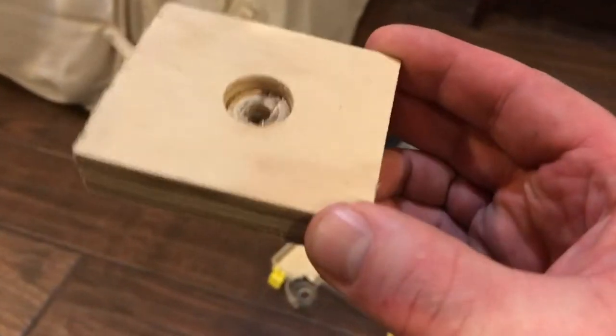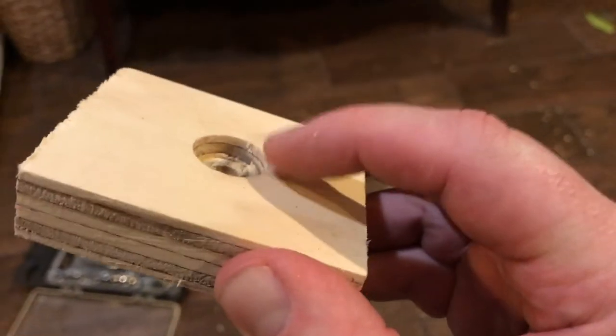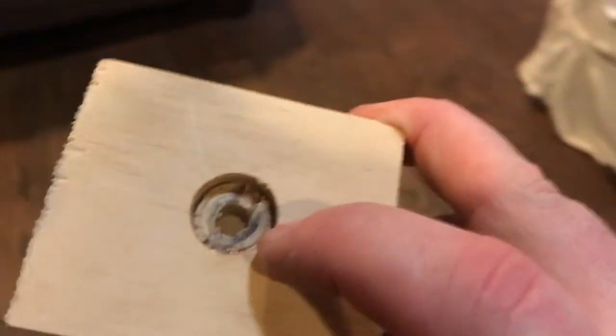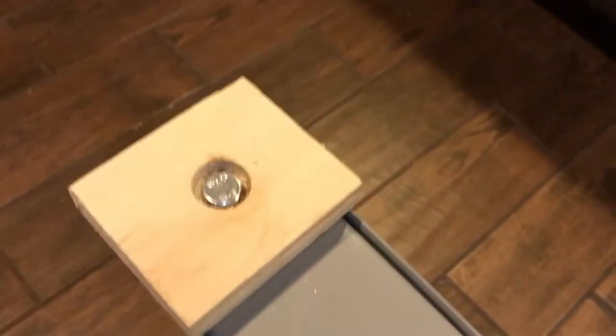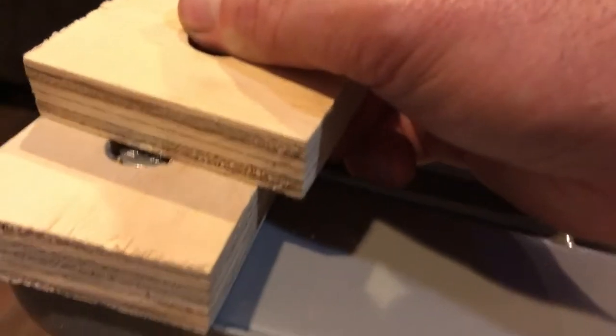You're going to take a wood block — this is one I've already made. Where I said to use the three-quarter-inch spade bit, that's to drill a hole right here so you can recess the head of the bolt, because the block is going to sit upside down against the frame. You want it recessed so it's not sticking out. After that hole for the bolt head, I used a five-sixteenth-inch drill bit to make the through-hole — which matches the thickness of the bolt itself. You can see the block here with the bolt recessed in nice and flat underneath.